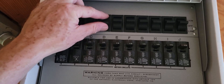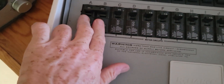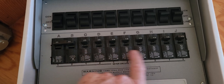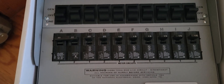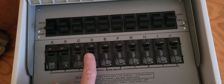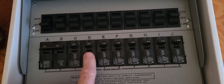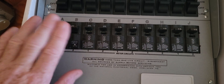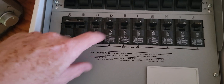Generator or line — these are interchangeable and you can use Square D breakers or anything compatible in here. This one is pretty handy because it has two 20 amp circuits and the rest are all 15 amp. There's one double throw 20 which you can change over to 30, and these two can also be changed to 30.